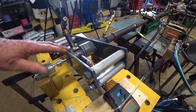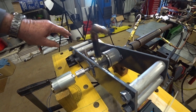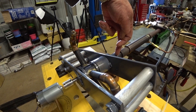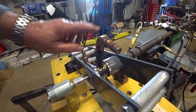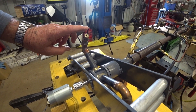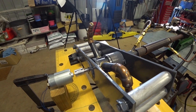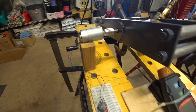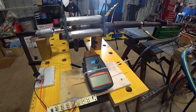This whole thing is just a frame holding it on here because we've got support bearings on either side. There's a bearing either side, this part spins, and in the center the air and fuel mix comes up through the center and is distributed through the three tubes, coming out as jets. The jets cause high pressure which causes the jets to rotate hopefully. The small motor here will give us an idea of what power we're going to get out of it, and the tachometer will let me see any changes in RPM.